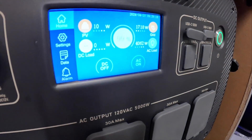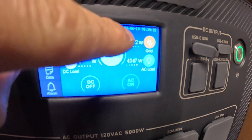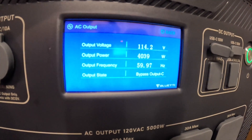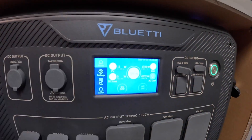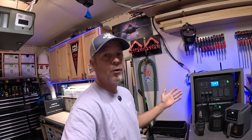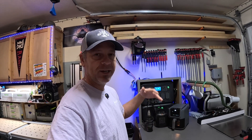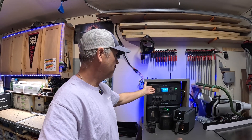We're pulling 4,063 watts right now, and we're inputting 1,700 watts from the grid — 1,800 watts is the max with my current cord. Going into AC load, my voltage is 114.2 volts, I'm outputting 4,040 watts at 60 hertz. I've got three of my highest-power devices, each pulling around 1,500 watts essentially, and it's running them absolutely fine. That is just crazy. And it ran my table saw too — it's easily running 4,000 watts with another 1,000 watts of headroom.